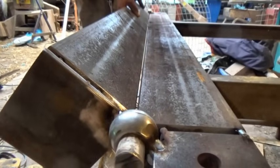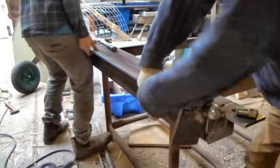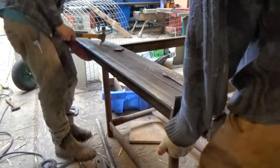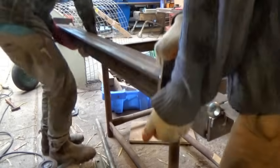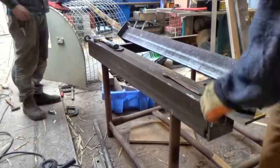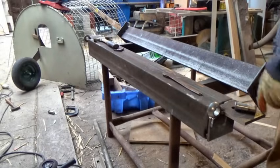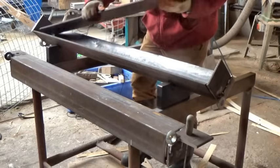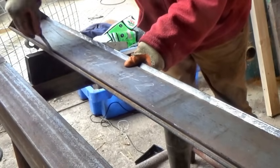Welding makes steel super hot and that makes it move around a little, but we made this so we can take it apart and grind off the parts that ended up too close. You'd be bored silly if I showed all the grinding and the cutting and the extra fillets we had to put in to support the hinges. This is just twisted slightly underneath — we just need to flatten that off a little bit. This sort of metalworking is a bit noisy and smelly, but it's very satisfying too and I would totally recommend my MIG. How did I manage without one all this time?